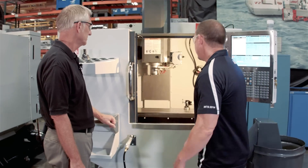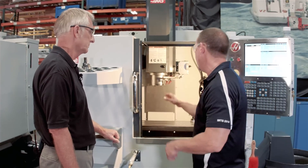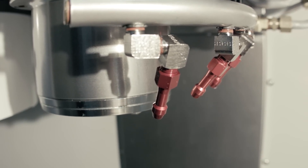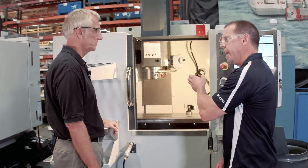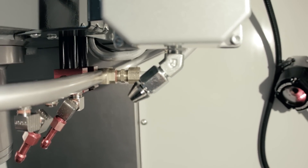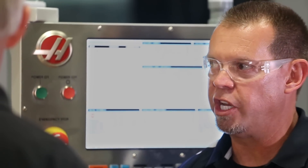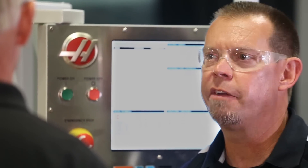Moving to inside the machine, another thing our customers really like that we've had on the BMCs — you've brought it to the Mini Mill — you've got a coolant ring in here now. It's been very popular on the BMCs, so we made a smaller version. It puts tons of coolant right on the part, right on your tool tip, right where you want. You can adjust each nozzle independently. And of course the option we've always had is P-Cool — you can still add that on any of the Mini Mill series. P-Cool's great; it puts the coolant right at the tip or wherever you want it. That's a big deal, especially on a machine like a Mini Mill where a job shop may have many different job setups at once — you can have a different setting for each tool.